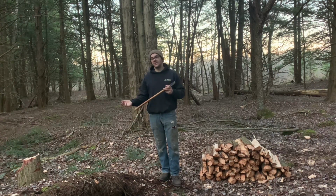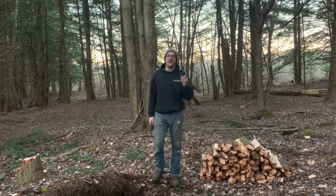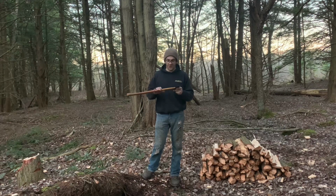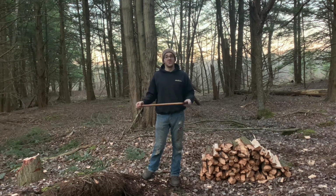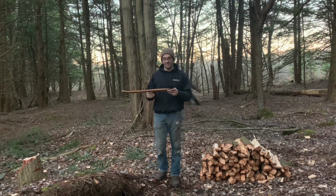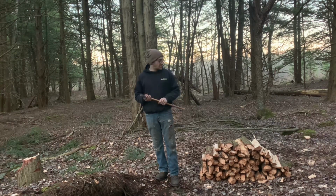Now, like I said, I don't know if that's a heat treat issue, but if you haven't checked out Urban Lumberjack's last video, he tests the Rockwell hardness on this axe. I'll see if I can link that in the description. It's definitely a good watch, and I encourage you to check that out, because he did believe that he was experiencing maybe a bad temper, and I thought the same thing myself. But I think the solution to the issue here, guys, is maybe putting a small micro bevel on it. And since I did that, I have not seen any edge damage on this axe.